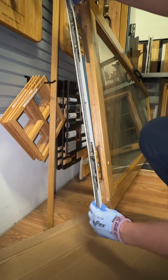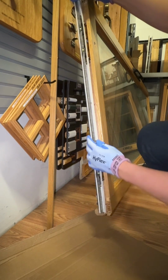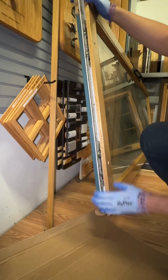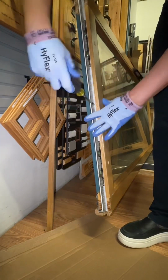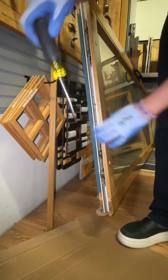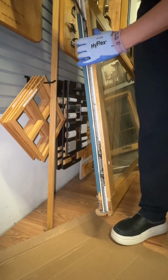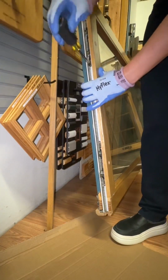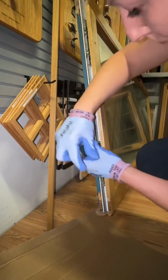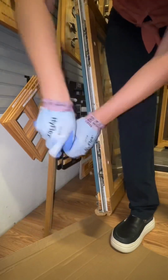Now to install it, we're going to slide it back into the mortise part of our door, and then reuse the same 5 screws to screw this down. I first screw down the 505 U-channel weather strip. That can be optional depending on your door, and then the 2 screws that screw down the rollers. Each roller has 2 screws on either side.